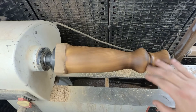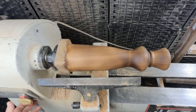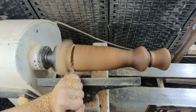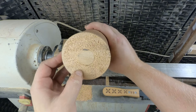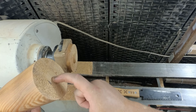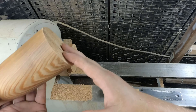All right, pretty cool. Now I'll get my parting tool and cut this thing off — I'm not gonna go all the way through because you don't want this thing flying at you, but you're gonna go almost all the way through and then finish it off with some kind of saw — hand saw, whatever you've got. Okay, looks good — but if you guys are following along, you know there's one issue: there's supposed to be a hole going all the way through and there's not. So I'm gonna go put this on another piece of wood and try to drill straight through.